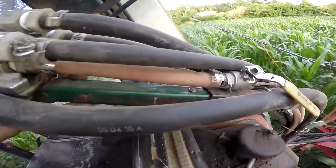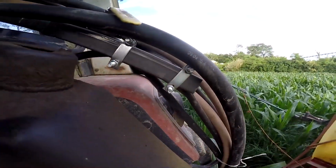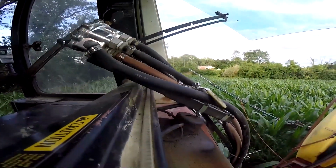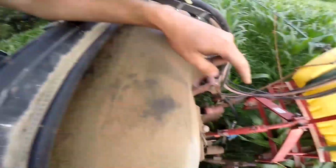it'll slide right out. I'm not gonna slide it out. And we made it not permanent, so we can take those clamps loose and that tubing out, and we can put the controller on a different tractor, like if we want to spray with the 14 or the 2+2, because we're crazy. By that point, we'd have to get saddle tanks to make it worthwhile to spray with the 2+2. And we got the pump running off the 1,000 RPM down there.